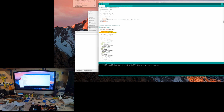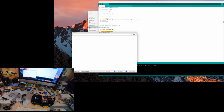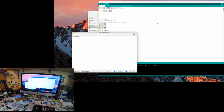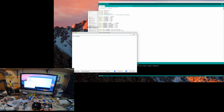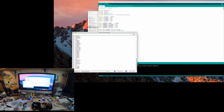And then what I've done is you can open a serial monitor, which I've done here. And I've opened that at 9600 baud, because if you look through the code, that's what it's set to. Now if I grab this and press forward, I get a little code come up, 167395. If you look up there, forward is 167395. So that's good. So if I now press number 4, I get a new code. Number 5, another code. Oh, hello, 2 codes there. I have to say, you don't always get the code you're expecting, but I think I've got enough times to get through. I think it depends on the timer stuff.